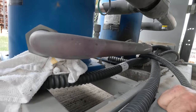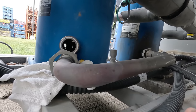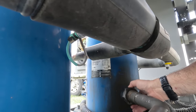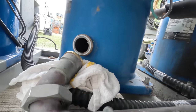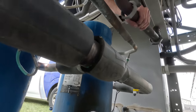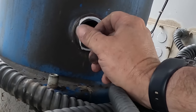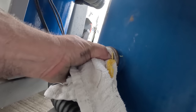Look at that — the oil came out awesome. That's good, that's what we need. I've got rags there in case. We wanted to switch the caps off of the new compressor to these but unfortunately we really can't do that. Look at that O-ring there versus that O-ring there — the one looks good, the other one looks smashed. That might be where our leak was — it got smashed in there pretty good. We'll drain that and get this thing out of here.